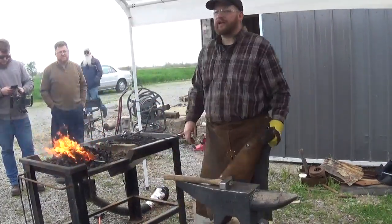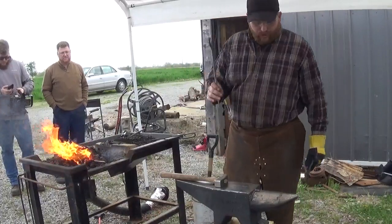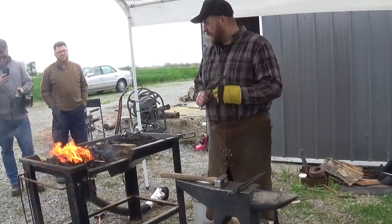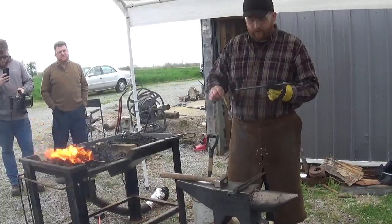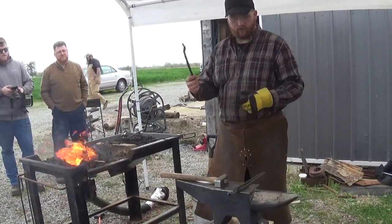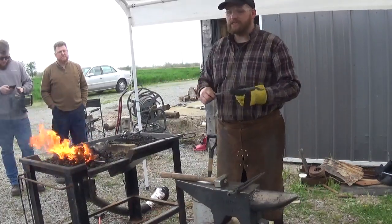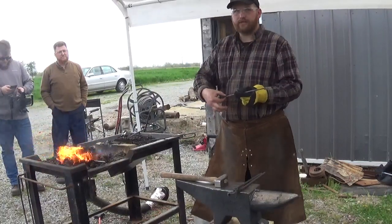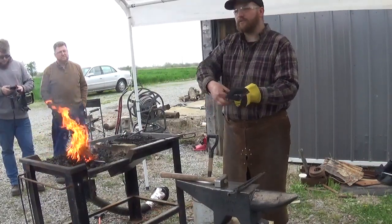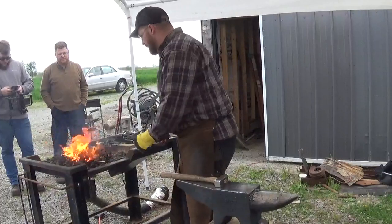So that's the hard part. Now the rest is just drawing out the material of the bar stock. We're going to flatten more of that area behind it. You don't need a massive amount of material to make your reins. I prefer reins that are very light — thin, lightweight tongs. I would rather stretch the material out and get it to the length I need, and not have a whole lot of thickness in this direction. You need thickness in the squeezing direction, and thinness in the other direction to lose the weight. Even a small piece like this 3/8 material has a lot of material you can move.